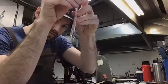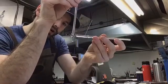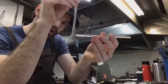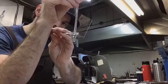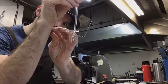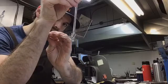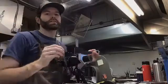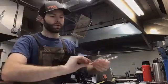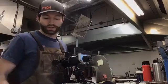So again, the steps are, we're straight, we got 1 straight rod of glass, gonna bend it 90 degrees, let that cool for a couple of seconds, heat up about 1 inch of material, bend it up and over to make our question mark, let that cool for a second, heat it up again, and then pull it back and push it in to make that final connection. And that's how you're gonna make a really nice, even, fluid loop. And as you get more comfortable doing it, they'll become more fluid.